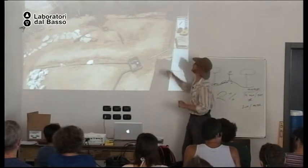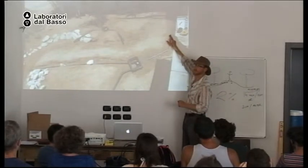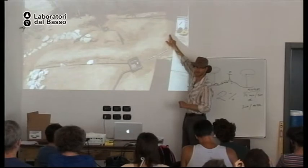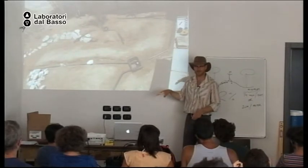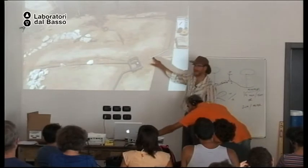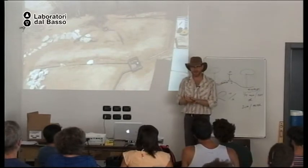Okay, so I will glue within 3 meters of the house, for sure, I glue it. Because I don't want to risk the pipe coming apart and leaking water under the house. But with this black pipe that we use in the United States, it fits together very well without glue.